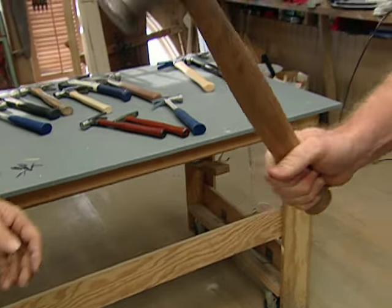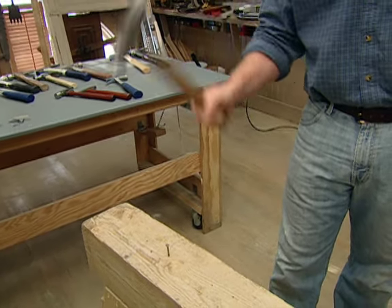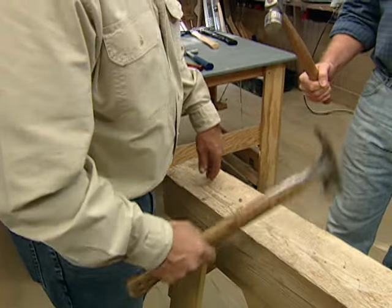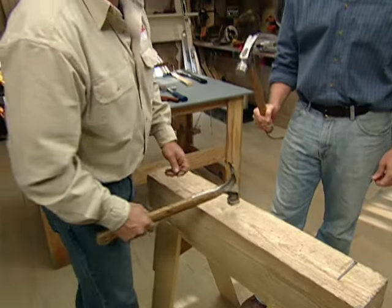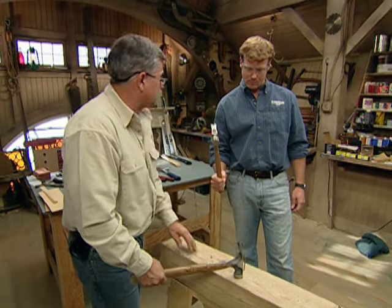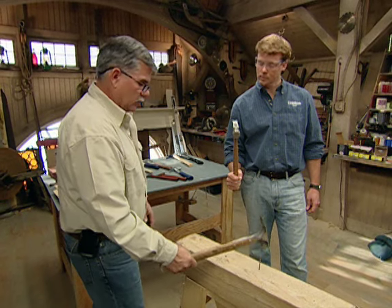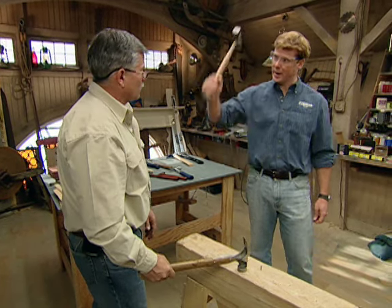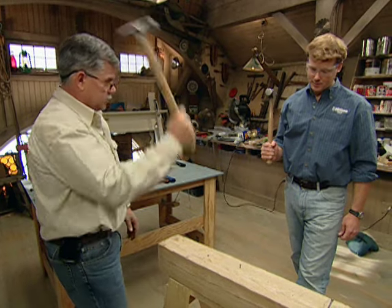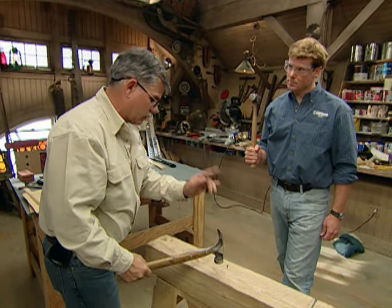Now let's see your drive. I notice that you're swinging like this — you're not letting the hammer do the work. What I like to do is whack the nail a couple times to get it started, then use the hammer along with my body. Take it back up high and drive it down. You want to come back up high and look at that nail — just continue right down. If you look away and you see your hammer head, you're going to miss the nail.